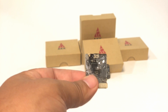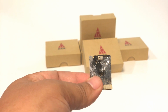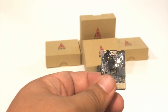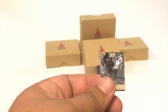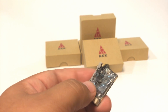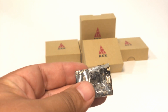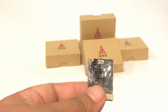Now, this does work fine for your receivers because they don't see much moving around or much adjustment, or ever a need to pop those off except in rare situations where you destroy an antenna. But for your video transmitters, these need to be flexible. They need to be able to be swapped out. As Joshua Bardwell always says, they are not built for that many mating cycles. After a few times, these little connectors can break, they can rip off, in a crash they can move, they can easily become loose — they just don't stay.